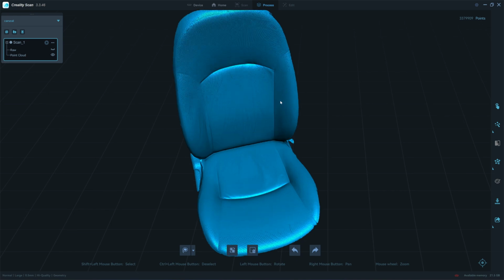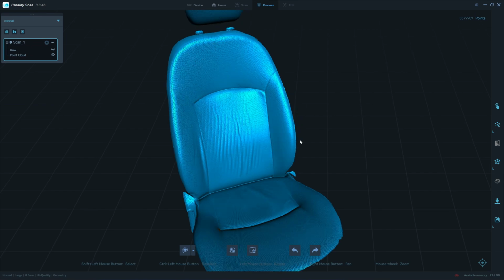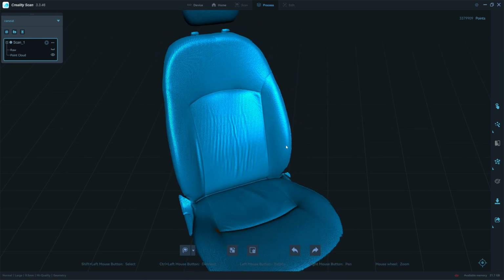When reversing the pattern for the car seat, I will use Blender's shrinkwrap function to create 3D lines, because the shrinkwrap function is very good and quick. Then I will import the 3D lines from Blender into Autodesk Inventor and create a surface, and then flatten it, because Inventor has a flatten function that lets you unwrap the car seat pattern into a flat pattern, and you can send it to the CNC cutting machine for cutting the pattern.